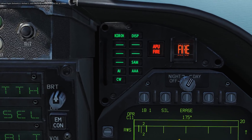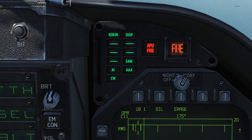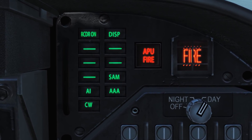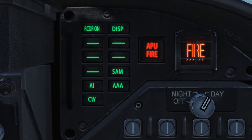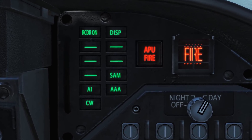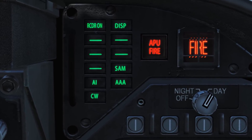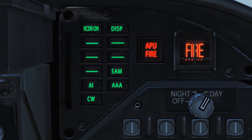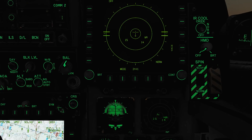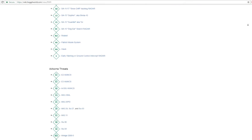On the top right of the instrument panel we have the advisory and threat lights. These are: AI for air intercept — an aircraft detected within lethal range; CW for continuous wave radar detected; GRAM indicating a radar is probably guiding a missile or will be soon; SAM meaning a surface-to-air radar has locked on; AAA meaning a radar-directed anti-aircraft system has been detected; and DISP, meaning the CMS has detected a threat, selected a program, and is waiting for your consent as the pilot to deploy the countermeasures. The RWR, or radar warning receiver, is very similar to other NATO aircraft.